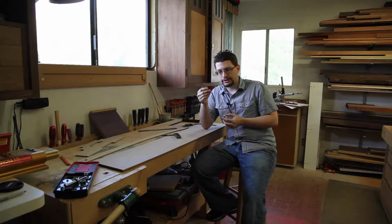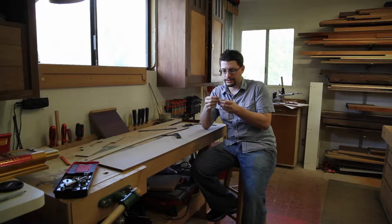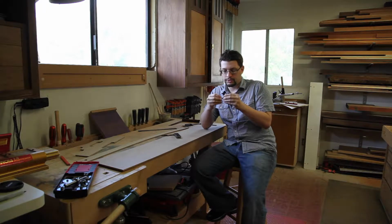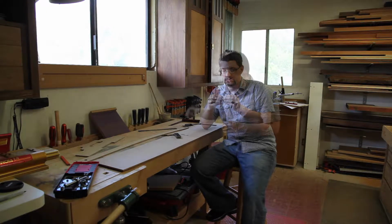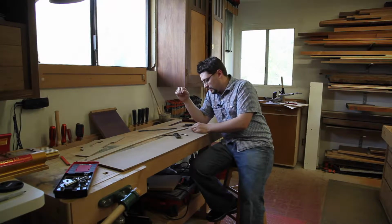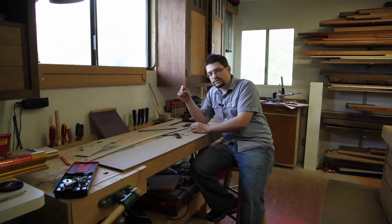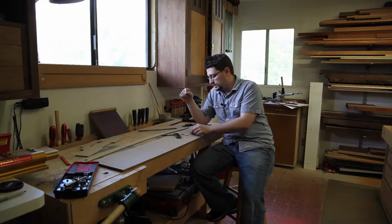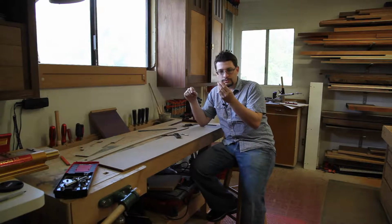So here's my 1/4 inch bit. It's a spiral bit. So the 3/8 of an inch bushing and the 1/4 inch bit have enough room that I can use this bushing and this bit here. We need to now come here and find, well, not the center, but the edges of this line where this bushing would meet.